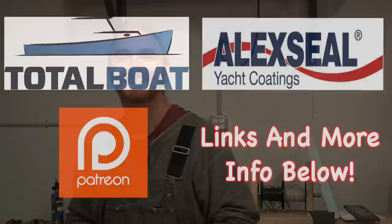My name is Andy with Boatworks today, and this week we're getting the transom on the Bertram 100% prepped and ready for layup. We're also getting all of the fiberglass cut, so that is just ready to go, as well as we're gonna cover some tips and tricks when we're working with 1708 so that we don't shoot ourselves in the foot by accident, of course. So with that said, let's get started.